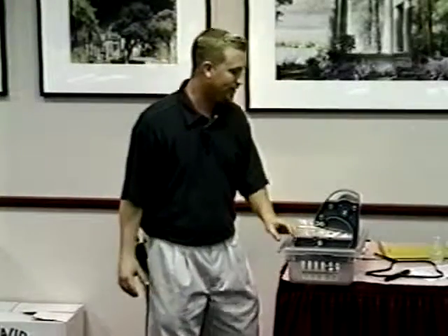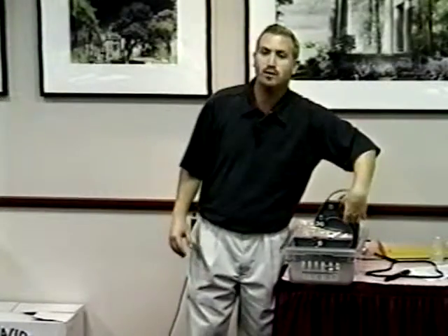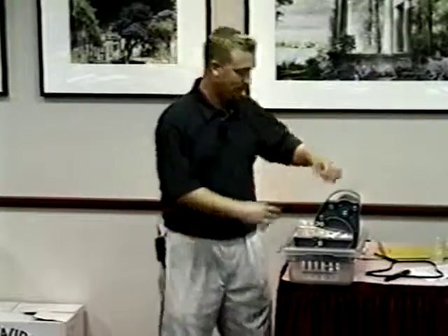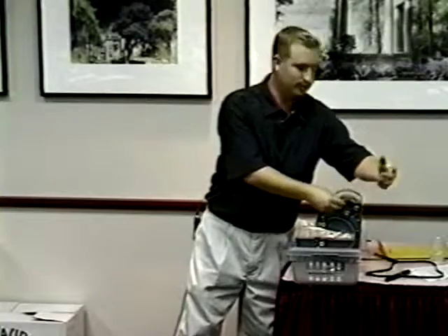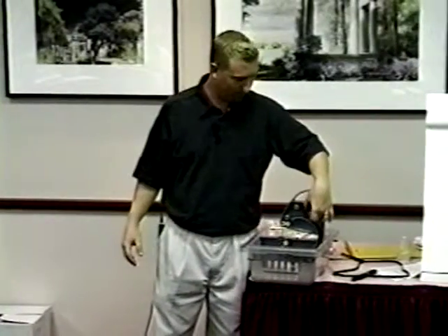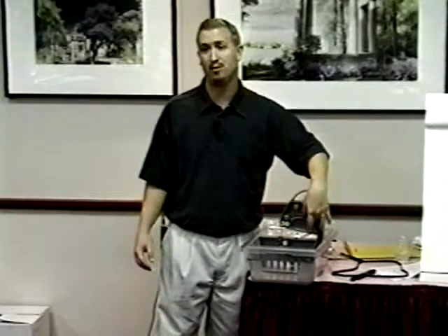We're really concerned with tight tension, so let's address that. Go ahead and rotate the drive gear right now. You can move it with your thumb and forefinger — nobody's breaking a sweat. We rate ease of turning on a scale of one to ten. Without the belt, rotating is a one. With the belt on, it should be between a four and a six — you can rotate it relatively easily with your thumb and forefinger and you feel slight drag, you feel that belt pulling. A ten means this thing doesn't move at all, which happens if you put the belt on wrong or if your motor burned out.